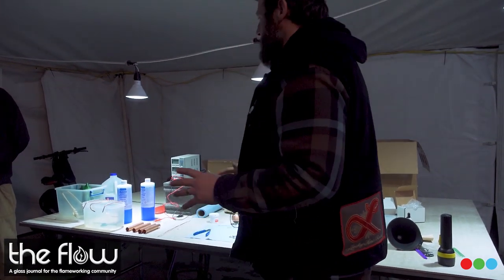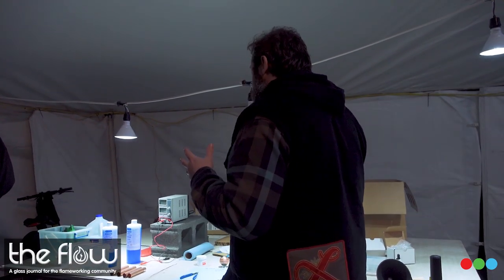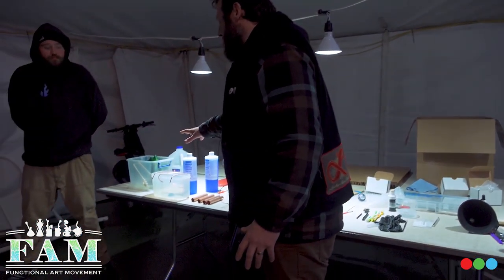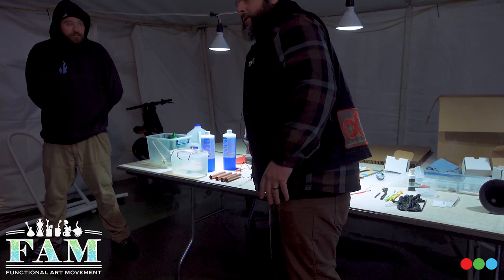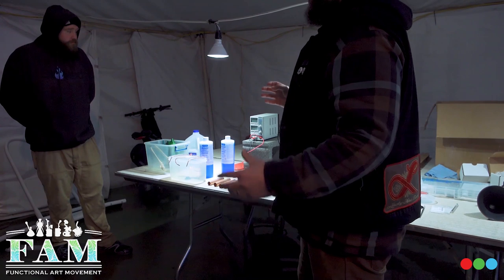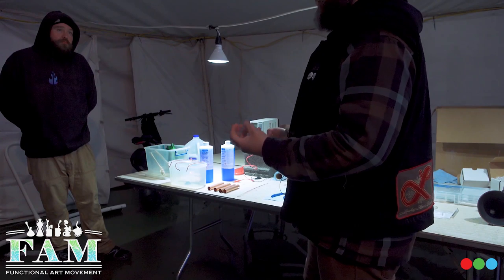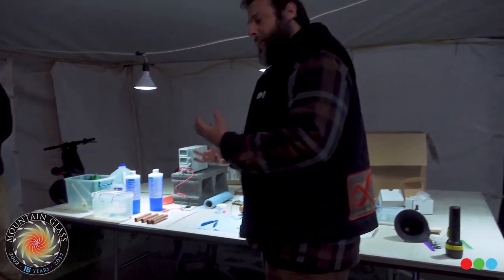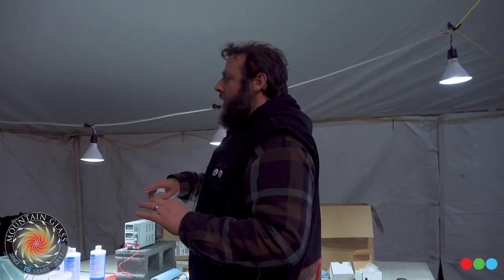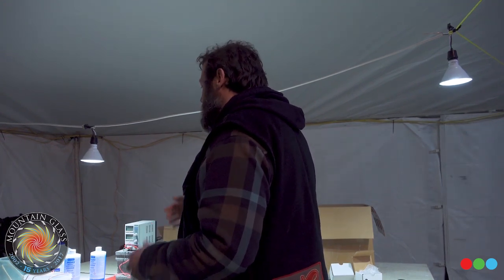So that's what I have to offer you guys: the information on how to have a small setup. Once you get twice this size, you start to require a larger power supply. And there are a lot more issues with the bath as well, as far as getting everything to run smoothly. You have to go into agitation, which is where little air bubbles are blown into the electroforming solution. You have to monitor your temperatures. Lots of them have an ongoing filtration system where it's constantly filtering the solution. We don't need any of that with this setup.